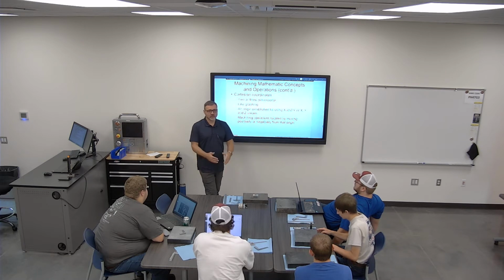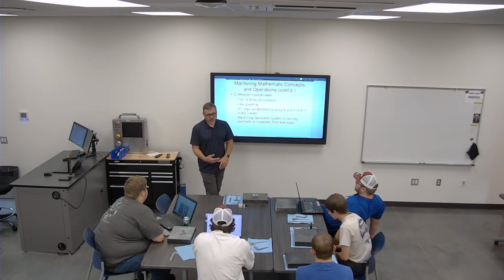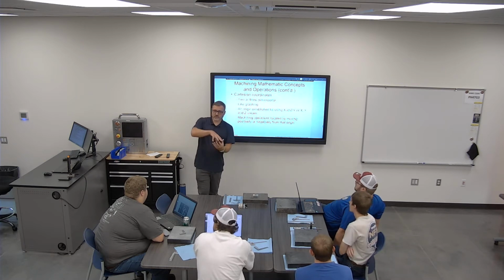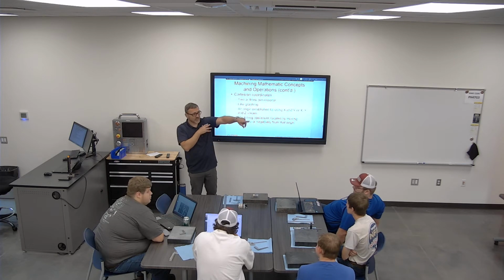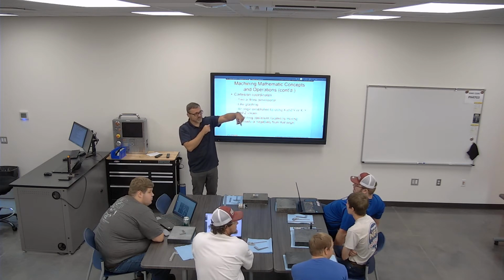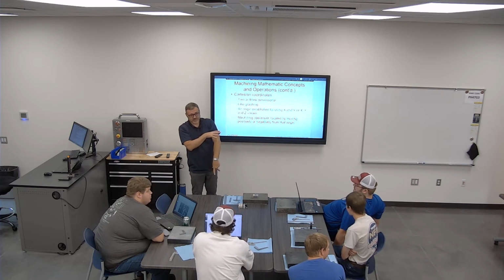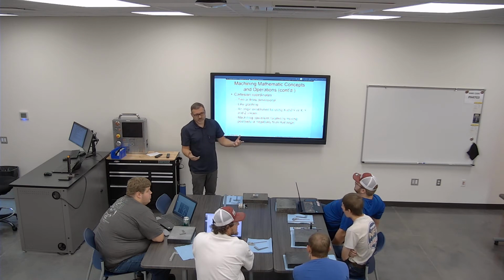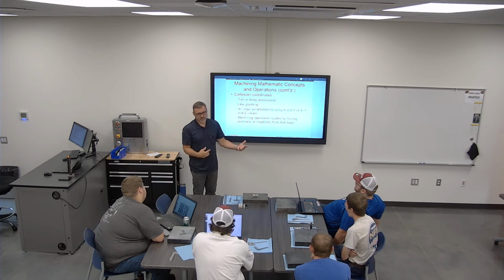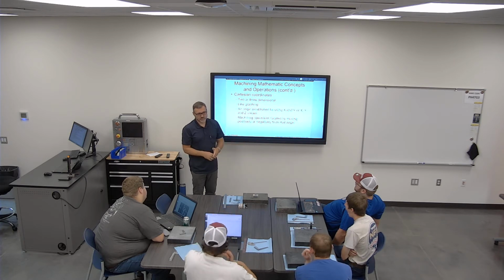It's knowing what it is in the world, what it is to the tool. And so when the tool gets flipped around, X, Y, and Z begin to follow those things. So Z positive, like how I've got that robot program now, Z positive is down. And then if I switch it around for the world or for the tool, whatever it might happen to be, it's all fluid. But it makes it nearly impossible to program if you can't do those things. I always work in world because that would just confuse my head.